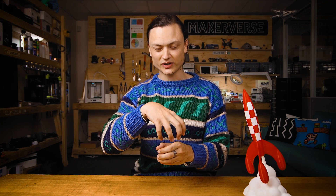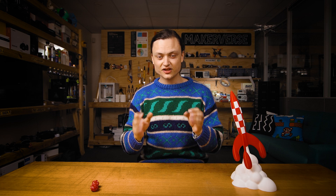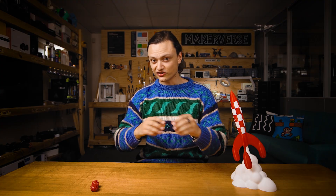Each colour needs its own unique CAD model, as printing is done by overlaying these two models in the slicing software and then slicing it. This is what enables dual coloured printing with dual extruders to work correctly. This means you either need to design each colour as a unique part or separate a full body into multiple parts. So keep this in mind when you're designing your components.